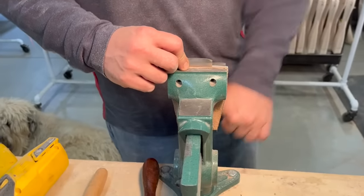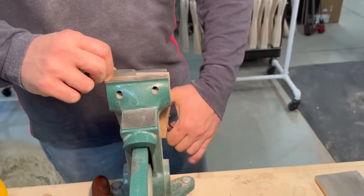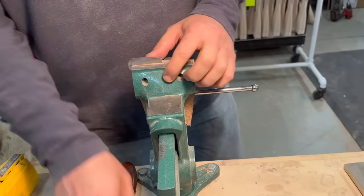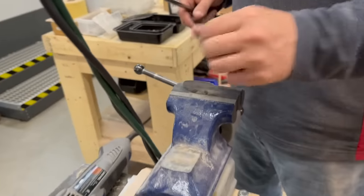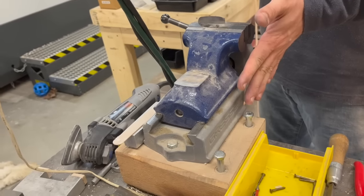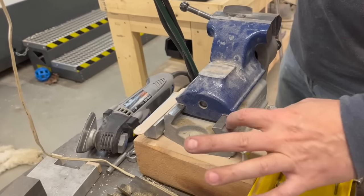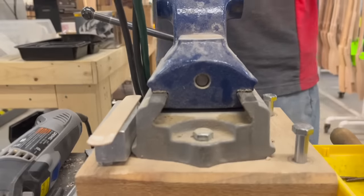Now with the curved scraper, we'll do the same thing. Clamp it in the vise. This is kind of an interesting vise. This is a Gressel vise. They're European style, so it's a dovetail vise. You can see the dovetails here. And the rear jaw moves rather than the front jaw. But it's a real good vise.